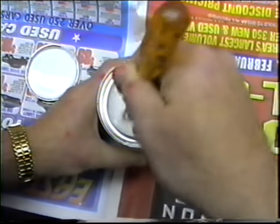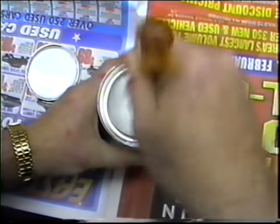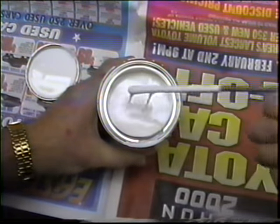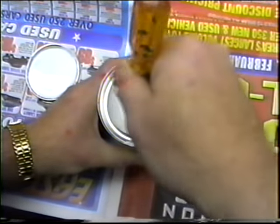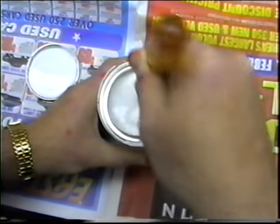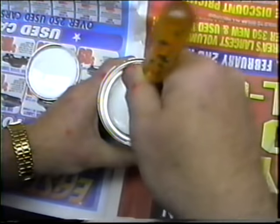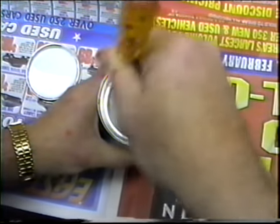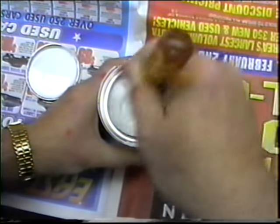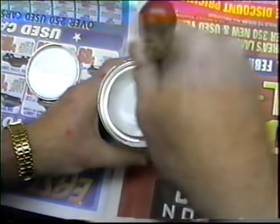Anytime a product takes longer to dry, you usually get more penetration and a better chemical bonding. Now if you were to just take the material off the top and leave all the filler down the bottom, well, it would kind of defeat some of the purpose of using this material. And to have a material that's this high quality and then defeat the whole purpose of it by using either the wrong thinner or some combination of not stirring it or whatever.